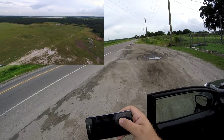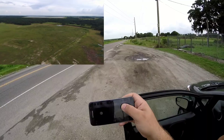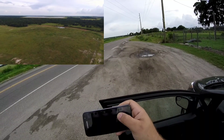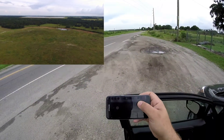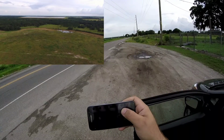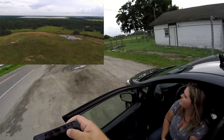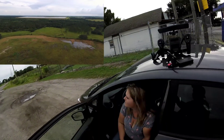Coming up on 800 meters. I built that Wi-Fi repeater system for 35 dollars, and it does just as good as the sky controller. Coming up on 880 meters — still have perfect FPV. We just cleared 900 meters, still going, perfectly clear FPV, and that is with 7dbi high-gain panel antennas. A bird flew by — he was like, 'what is that?' Still going — 1057 meters. We've got 91% battery. In another 600 meters we're going to be just as far as the sky controller took us without issue. Those 7dbi panel antennas seem to do very well.